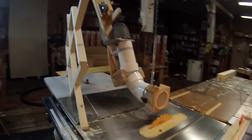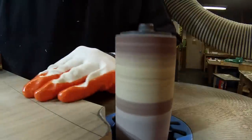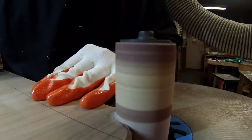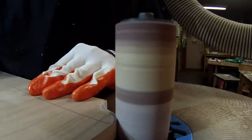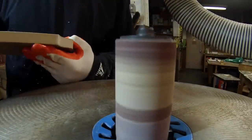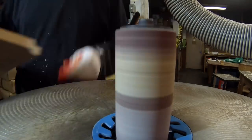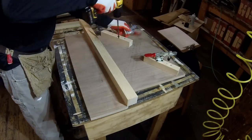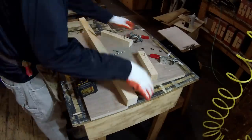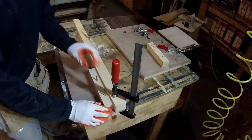Here I'm making another template using my oscillating drum sander. There's a little detail on the feet to make the base of this table, so I'm cutting a profile to make another template for mass production. I'm taking my other template apart and making a third template using the same toggle clamps — that's going to cut that little profile with a pattern-cutting router bit.